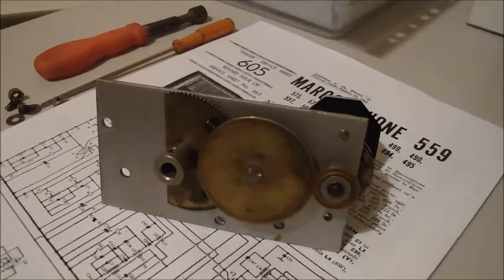It's almost been a week since I last showed you the Marconi — at least five days — so I thought I'd start this other part and show you what progress has been made since then. I've completely cleaned the chassis now, which involved removing the tuning capacitor, the dial, a few of the tubes, and the covers. I've just finished reassembling it again, all apart from the dial — I still need to give that a good clean.